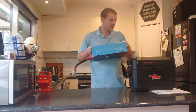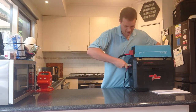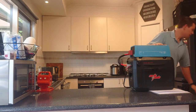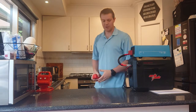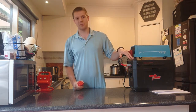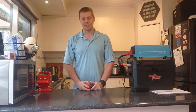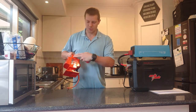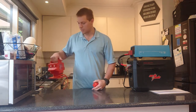I'll give you a quick demonstration. You can see the size of the unit compared to the battery box — it is quite bulky. One thing I do have to do is make sure to include an RCD. The factory does specify to use the ground on it to an earth circuit, however for my portable needs it's not really practical. As an extra safety measure, putting an RCBO on the output before you connect anything is a really good idea. I picked this one up for $30 from Bunnings. This other one was close to $100 — a traditional circuit breaker type switch — which is better for camping purposes as it's a water-rated product.